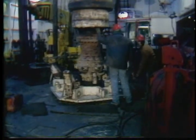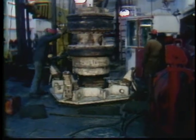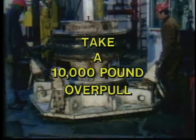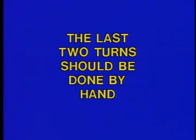Once you attach the diverter assembly to the slip joint, tighten down the locking dogs that lock the two sections together. The diverter can now be lowered into the rotary table and landed in the housing. After you engage the locking dogs and support dogs, you should take an overpull of 10,000 pounds or so just to see that the assembly is secured in place. Now loosen the running tool by spinning it off — this particular tool takes about 22 turns.